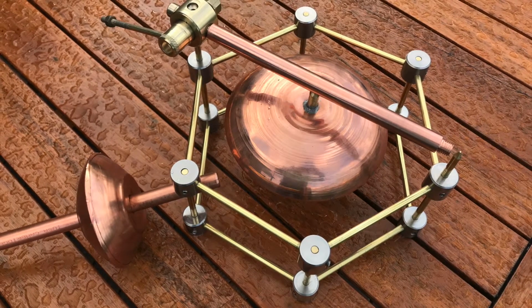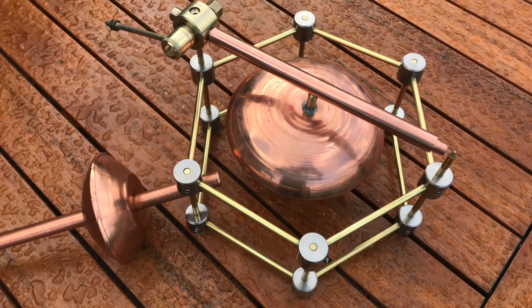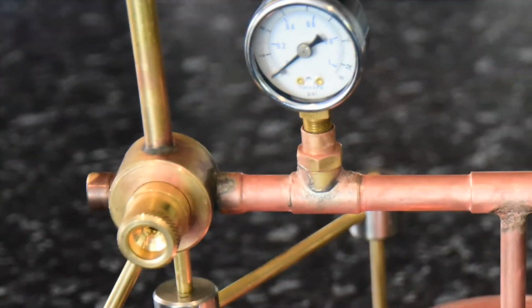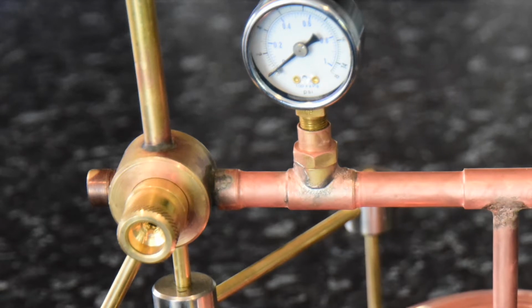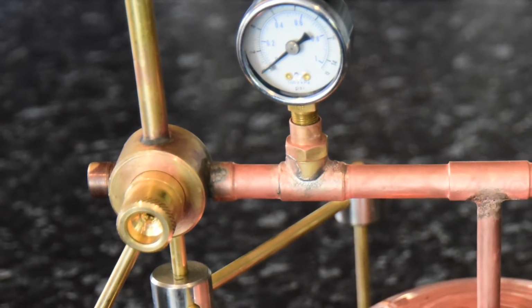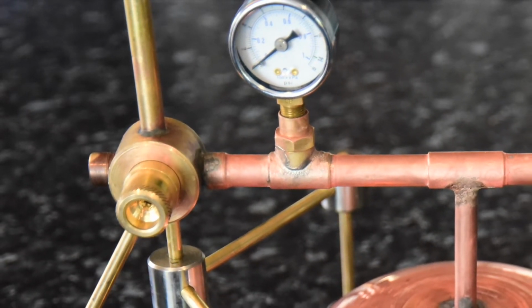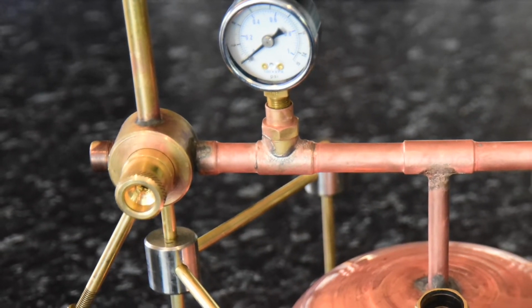This was made in the same way as the rotor, two bowls joined together with a rolled over edge which was soldered, and then it was pressure tested. I filled it with compressed air up to a pressure of 15 pounds per square inch, which is the cutoff of the pressure relief valve. The pressure gauge went straight up to 15 psi, and right on the dot of 15 the pressure valve opened, and there was no sign of any difficulty with the tank, no leakage or bulging or anything.